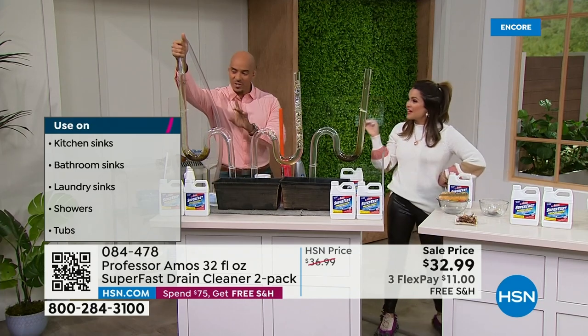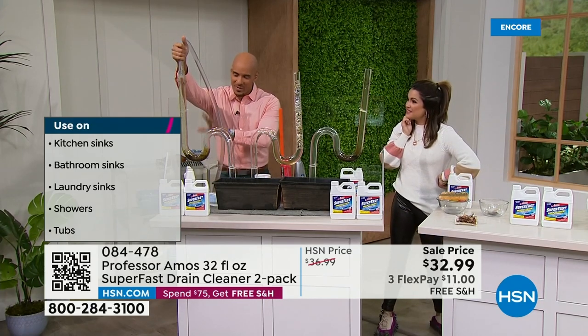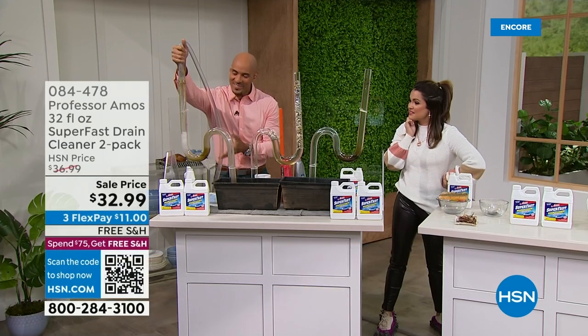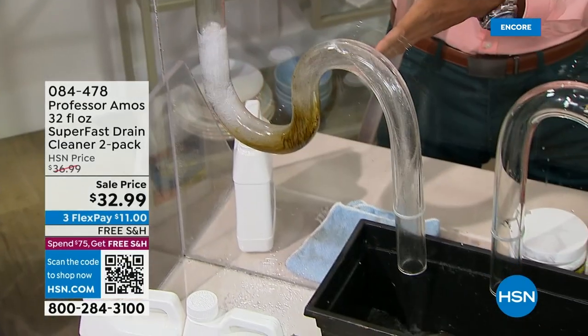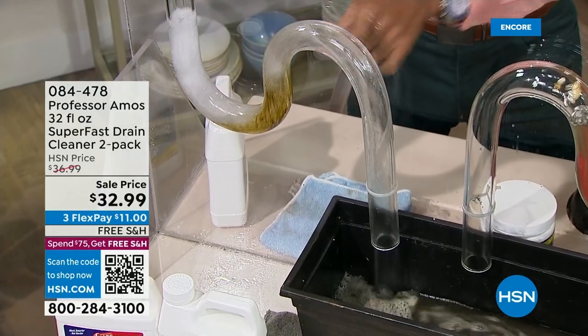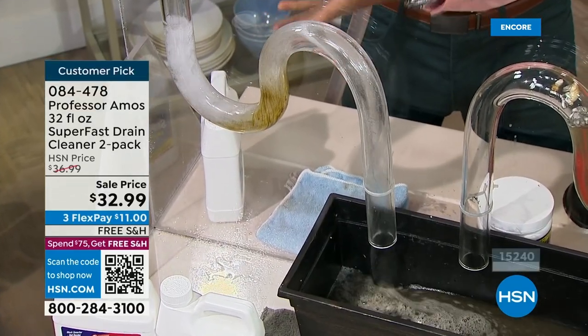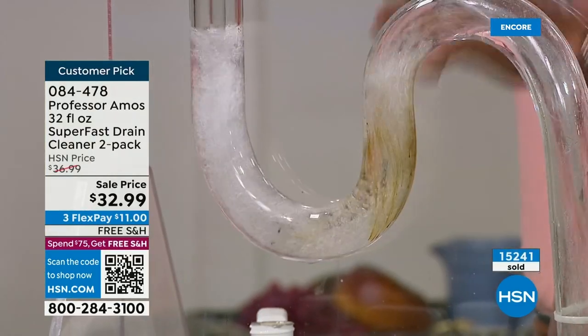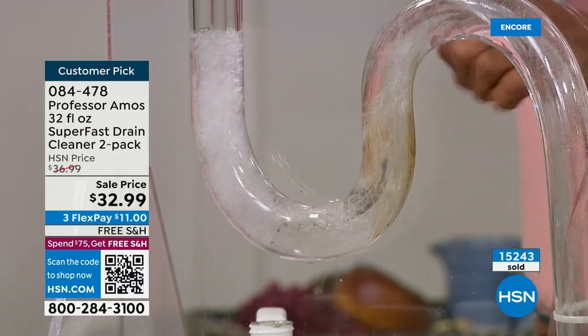All right, so here, I'm gonna get right to rinsing. Let me explain what happened. Everything has been suspended free from the inside of the drain line. It's all been broken down by being saponified. Now you run hot water for about 5 minutes and you'll see that drain line comes back squeaky clean every time you do it. Look at how crystal clear. There it goes. I love it.